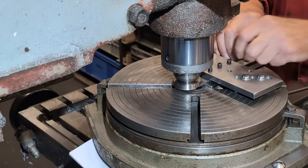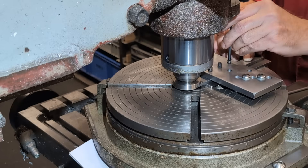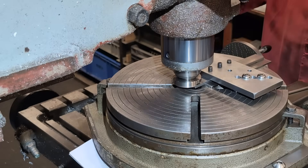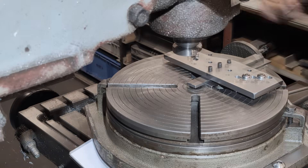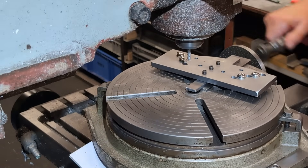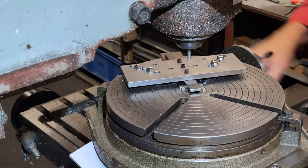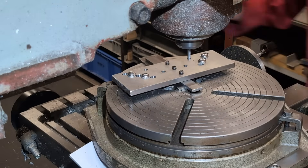You can then offset further in X or Y to compensate for cutter radius and any finish allowance. We start with a roughing pass using conventional milling, then shift to climb milling for the finishing cut. If you need to, you can also slot or drill afterward, all without needing any pre-machined hole.